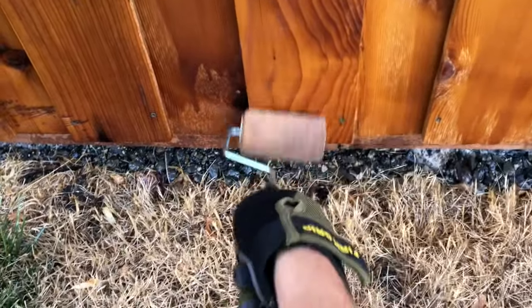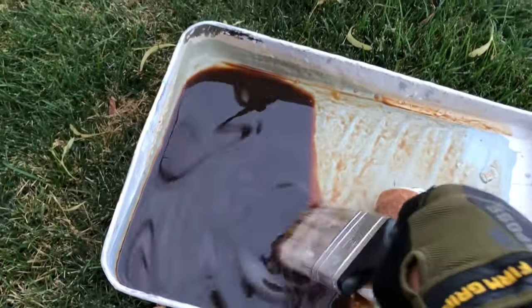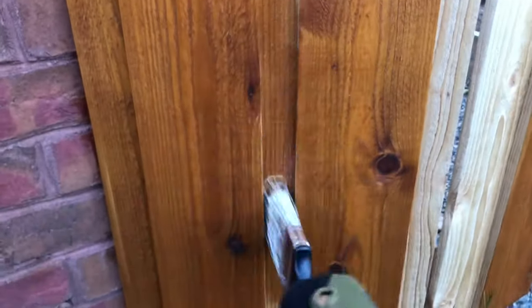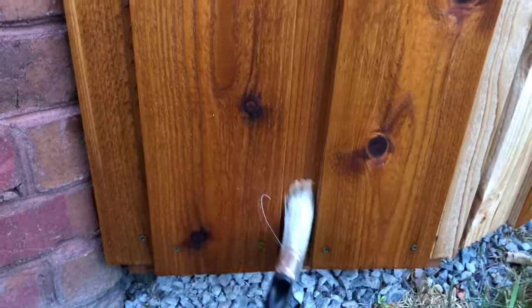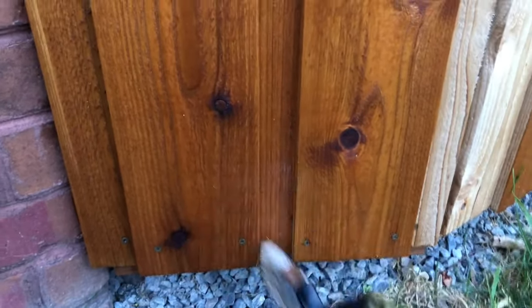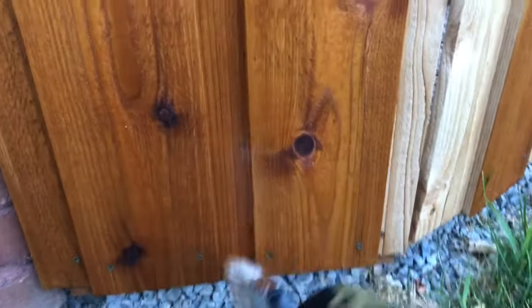I would just kind of even it out and spread what was on there with a roller after using the pump sprayer — worked pretty well. Using a paintbrush was a little bit challenging just because the stain is so thin, it's barely thicker than water. The brush just doesn't hold much without dripping off. A brush is really better used for spreading it around and filling in gaps once it's on there. I definitely wouldn't plan on doing any large sections with only a brush.